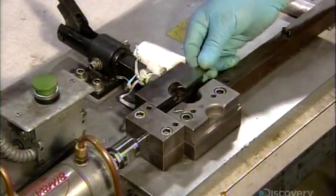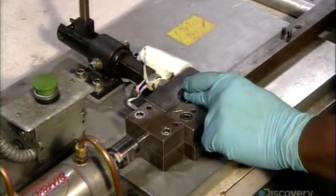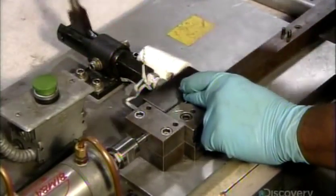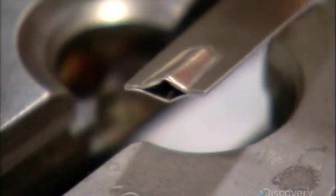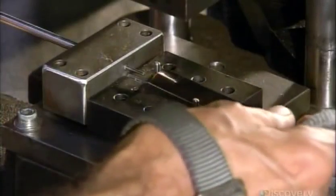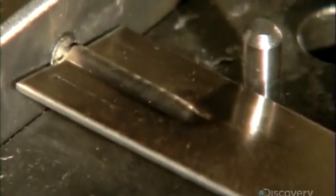A worker now encloses the tube in a die and drives a pin into its open end. This widens and redefines the opening from inside and outside. He slides it over another pin and activates a mechanical punch press. This fine-tunes the shape and dimensions of the opening.